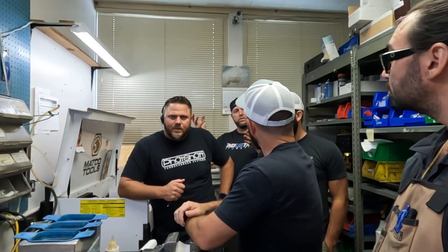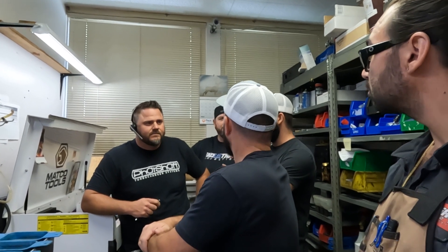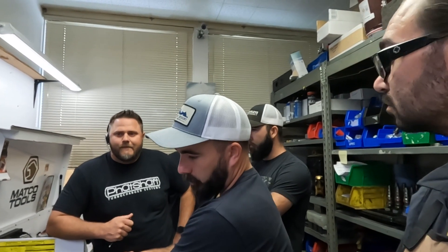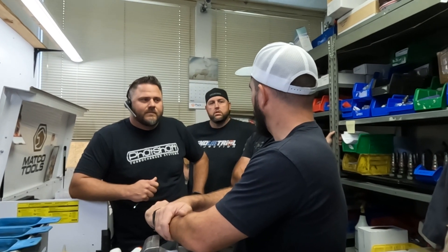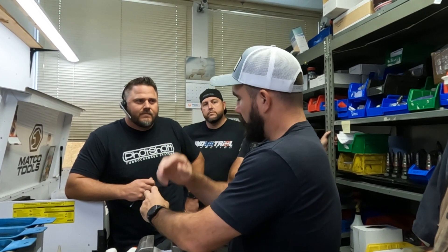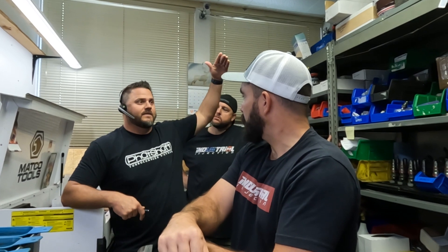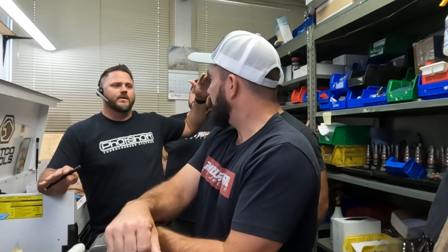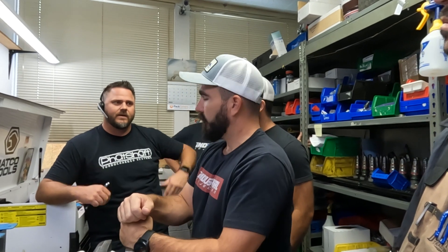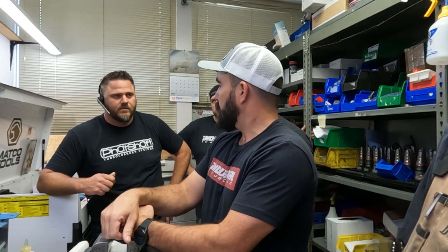The big problem is we'll sell to wholesalers or big warehouses and they'll put 20 on the shelf. Twenty doesn't get you even two complete sets of eight. Then if somebody is putting one in at home and tears something up during installation and needs a warranty injector, when they get another one back it's going to be the same spec — you're not going to have one that's a little different than the others. It would be easier for us to sell in sets of eight because we can be five high or five low on a set and it'll run good. But if you get one five low and one five high, instead of a differential of five CCs you could have ten. So yes, it's harder to do it the way we do it, but that way we can sell more and distribute more product.